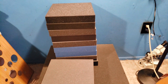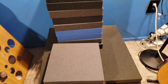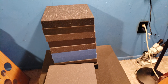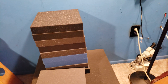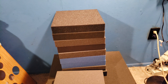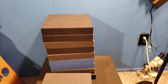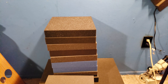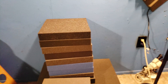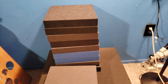I'm not going to get into all that. What I do want to get into is why acoustic foam is bad if it's cheap and the difference between them. A good acoustic foam absorbs evenly across mids all the way to highs. If thick enough, it can go a little lower into the bass ranges, but it will never go completely into the sub-bass range. The point of acoustic foam is to reduce echo and reverberation — it's not to soundproof your room. Cheap acoustic foam is just going to absorb the high end.